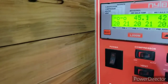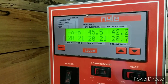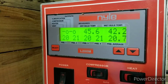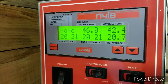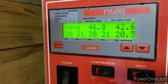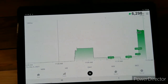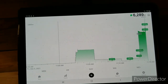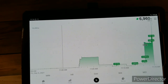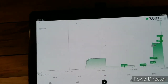What we have in here now is the temperatures — it's currently 45 degrees in there. It's going to be a little while for it to get up to a temperature where the compressor actually kicks on. You can see it warming up in there already. I'm going to leave the fans off for a little bit — but I'll turn them on just so you can see what this energy usage does. There's everything running now — it's on a steady almost 7,000 watts. Once that compressor kicks on, that's going to shoot even higher.